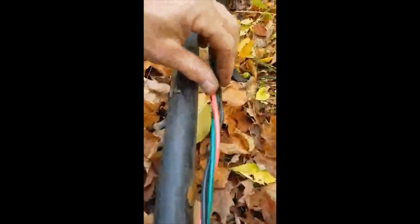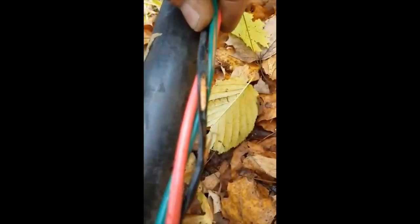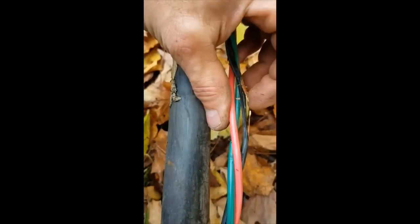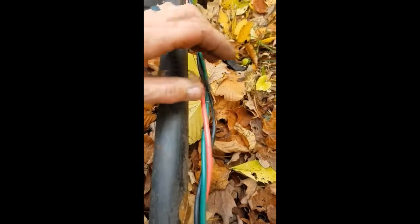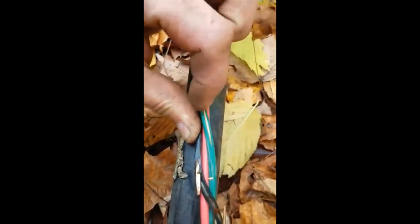After testing stuff and checking things out and going over the line, here's what we discovered. The wire chafed itself right through on the casing. It's kind of what I was afraid might be the case. And, well, as soon as it did that, it wasn't getting 220 anymore. So, boom, cuts the pump out. So basically, if you look right here at this green one right next to it, it was doing the same thing, hitting the casing. So it was only a matter of time.